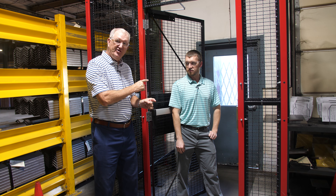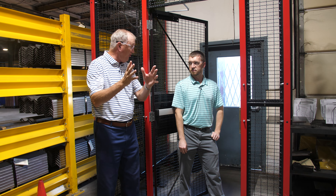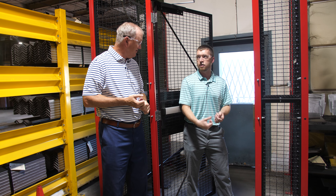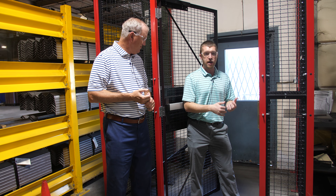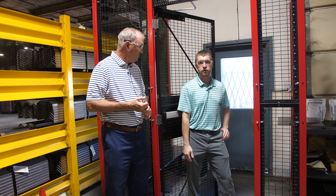What's even better is you can retrofit this to any door that's currently out in the field. If you already have a door with a hard strike and a mechanical lock and you want to add access control, you can add this strike in there. It'll fit in the gap of your door. The only thing you have to do to make it work with your current door is swap out the hinges — use a different hinge and it scoots your door over a little bit, giving you room for this strike.